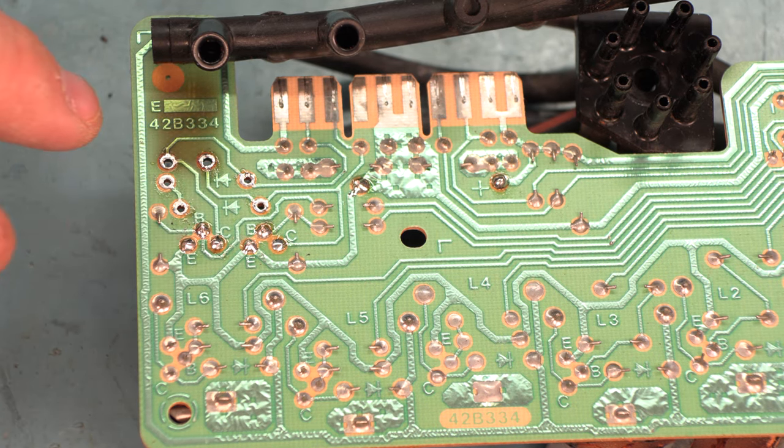This is how it should look when we're done — we'll show that from multiple angles. We want to make sure we don't have any solder bridges between any two solder joints, and that everything is filled in and looks nice, bright, and shiny. If not, just use your vacuum solder removal tool to vacuum the old solder away and solder it again. If it looks gray or crystalline, that's a sign of a cold solder joint and you should definitely remove that solder and redo it.